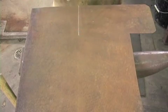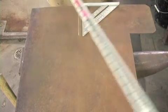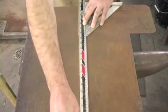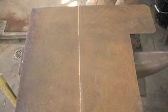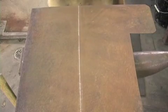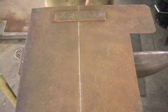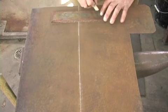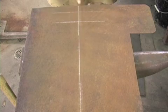The first thing I'm going to do is divide a piece of rusted tin plate in half. I've got a 90-degree square and something to extend that. My next step is to put the stock on — the type of stock I'm going to be using, in this case two and three-quarter inches wide. I'm going to trace two lines, fore and aft, so I end up with the two lines of the stock and then something perpendicular to that.